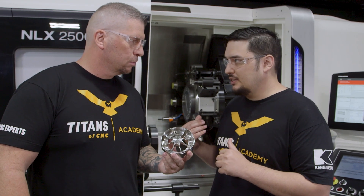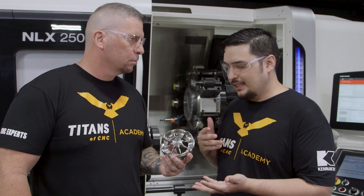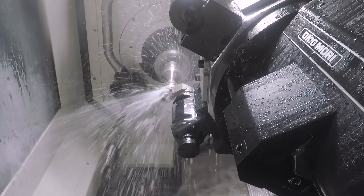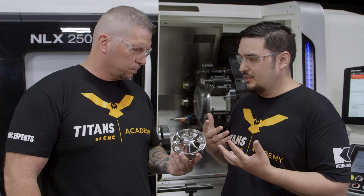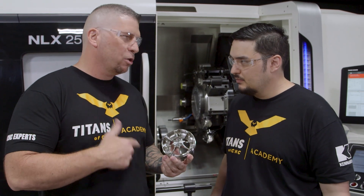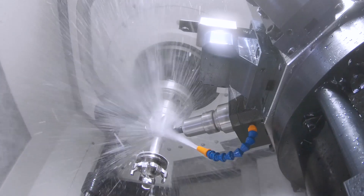It's a little bit overkill, but I like using the high pressure coolant on this machine for both the Inconel and the titanium, even on OD tools and groovers, because it helps blast away any chips that might be on the part, keeps the tool path clear, and makes sure I can get the coolant everywhere on the tool. You don't want to be running over those chips. And when you blast that high pressure, does it foam at all? No, no problems at all.